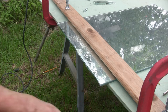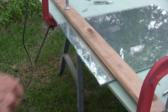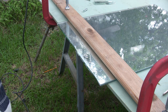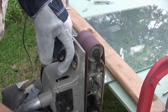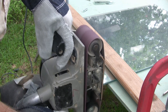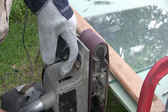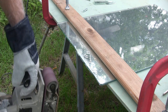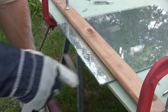What we're going to try to do is grind down to that little score mark from the glass cutter, just to give you an idea of how long it takes to remove about a quarter of an inch. You can see what happens — it's already getting hot and chipped the edge off, so we're not going to go any more. We went about an eighth of an inch.